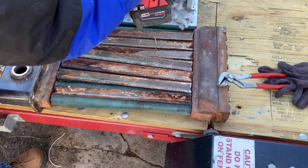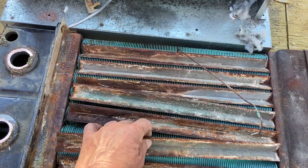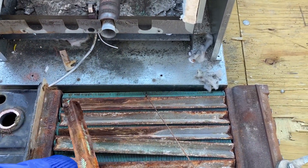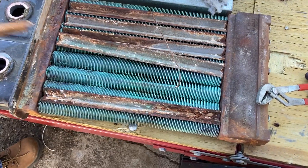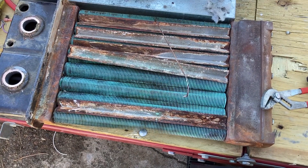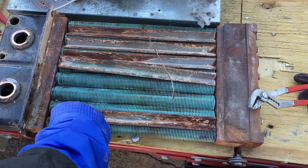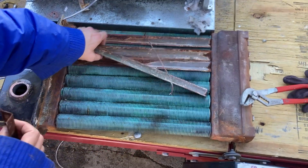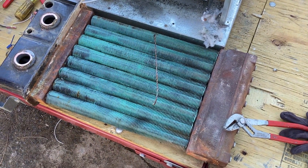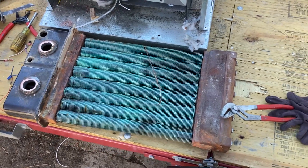Here's the heat exchanger laying down here. They've got these V-shaped pieces of metal — you can see how corroded they are. You can pull them off and the finned copper is below. It looks like somebody has cleaned this out recently; they're usually so clogged and sooted up you can't get heat to flow through them. There have been times in the past where I've removed two or three of those just to get the flue warmed up faster and to get it to vent properly.